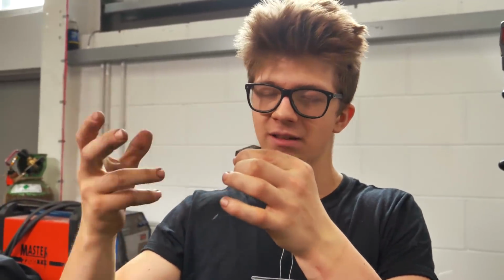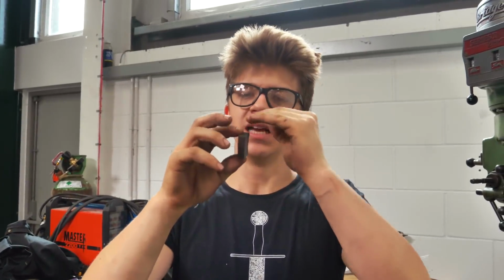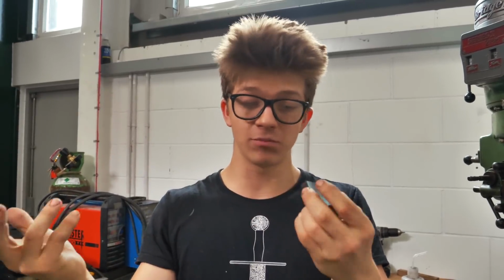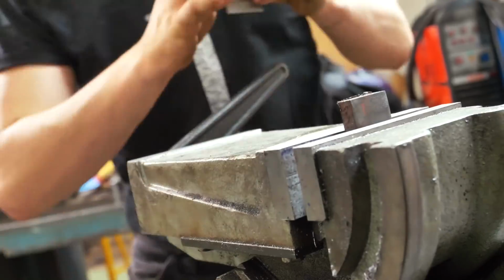What I'm going to try and do is at least imitate it, give the impression that if one was to make an appropriate fitting, it would work. I'm going to mill myself a little bit of a channel in there. For now, however, the first thing I'm going to do is square off 2 sides. We're then going to flatten off the top and bottom, get at least some flat surfaces, drill some holes, mill some things, have some fun, and abuse this old Bridgeport just a little bit more.